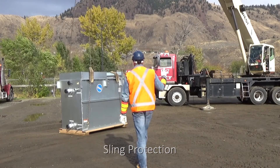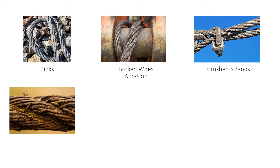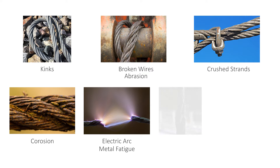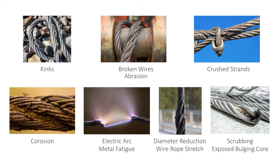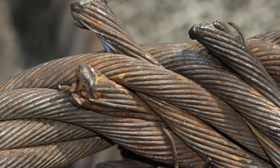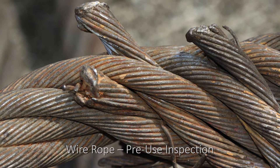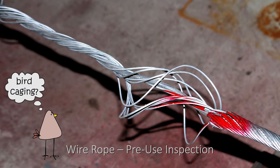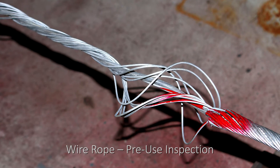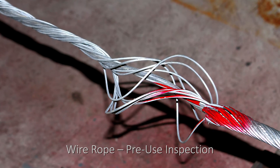Not doing so is the most common cause of damage to wire rope. Inspect wire rope for kinks, broken wires, abrasion, crushed strands, corrosion, electric arc, metal fatigue, diameter reduction, wire rope stretch, scrubbing, and exposed bulging core. The ropes illustrated here show the severe damage that results when kinked ropes are used — local wear, distortion, misplaced wires, and early failure are inevitable. Birdcaging may be caused by a sudden release of tension and resultant rebound of rope from overloaded conditions. One of the biggest concerns with distortion in the shape of the wire rope slings is that the wires are no longer carrying an equal share of the load.